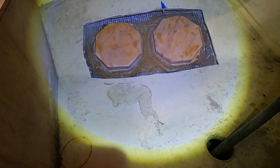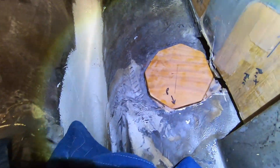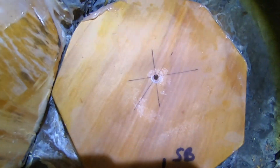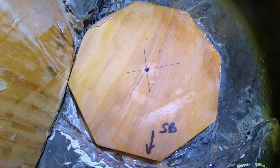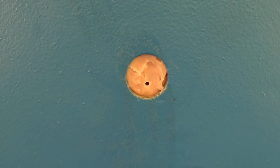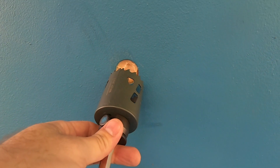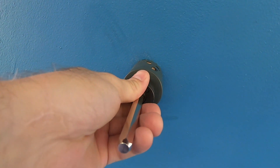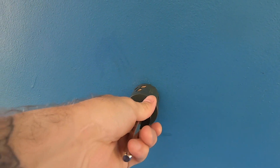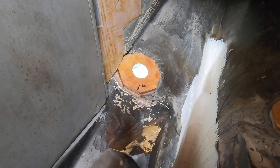I measured and did a cross-section to find the center, and I'm starting with this one here. I drilled a hole through it so I could find the center. When you go outside, that hole is the center of the backing plate. The new hole is going to be two and a quarter inches to accommodate a two-inch through hull. If I drill through using that as the center, the full new hole is going to encompass that, and it'll all be centered. So the hole is drilled.